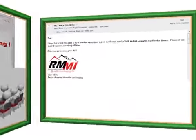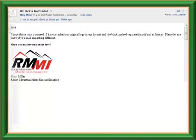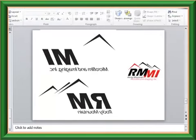So, this customer ordered by email. They gave us their logo as an attachment to the email. The logo art is color separated in full black. Of course, we use a graphics program such as Corel Draw. We then reverse the art because in pad printing, we want the image printed on the reverse side of the transparency sheet when we go to make the plate. That is so the image is in direct contact with the plate for best detail resolution.